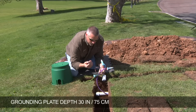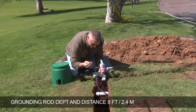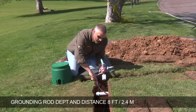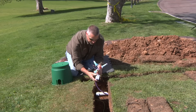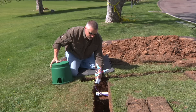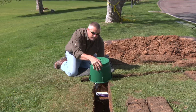If you're using a grounding rod, you need to install the entire 8-foot length of the rod into the soil, and it needs to be about 8 feet away from the two-wire path on a perpendicular line to the main line. And remember, any connections you make — any decoder, surge modules, or station decoders — you always need to use a valve box to complete your work when finished.